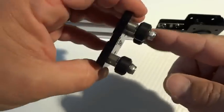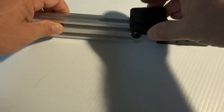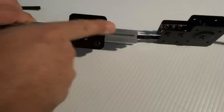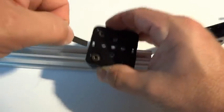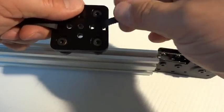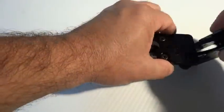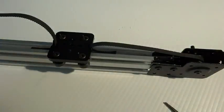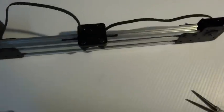When you install the cart, even though the wheel sets look like they're the same distance apart, they're not — you have to pay attention to where the eccentric spacers are in comparison to the regular spacer, because that's where the rail actually rides. You can also look at the belt mounting holes as well. At this point you could move this over and push your belt through here so you don't have to deal with it later, then do the same thing on the other side. Slide it on — there we go. Once I push this in we'll have plenty of room.